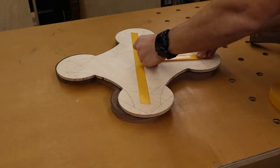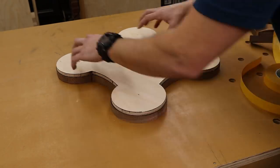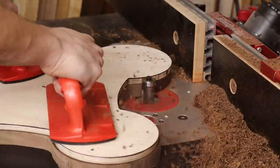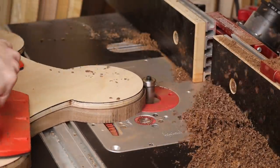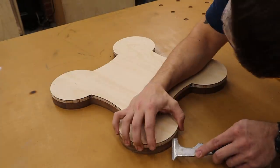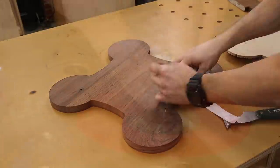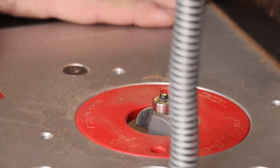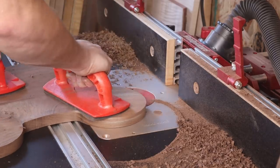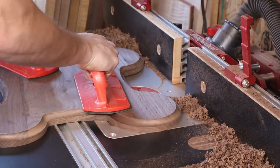Next, I added some double-sided tape to my template and then lined it up on my rough cut panel to get it ready for the router table. Here I'm using a flush trim bit to finish cutting the material so that it is a perfect match to the template. Now I can remove the template and double-sided tape and head back to the router table for some finishing touches. I installed a cove bit in my router table to route a groove on the bottom of the board — this will give me a nice place to slide my fingers in to pick up the board. Then I added a slight round over to the top to break any remaining sharp edges.